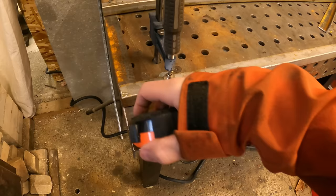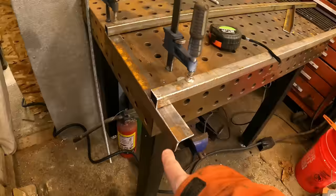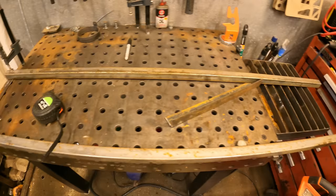Here's this little lap jig I'm building for both of my sawmills — it's going to fit both of them. This is some 1/8 inch by 1-1/4 inch angle iron, just what I had around. Some thin wall 1 inch tubing — these are 50 inches long for my needs, these are 14 inches long. Got them on my fitment table here, I'll weld them together and put another cross bar over here and over here to fit both different bunk sizes.